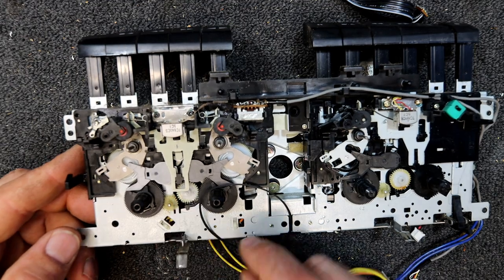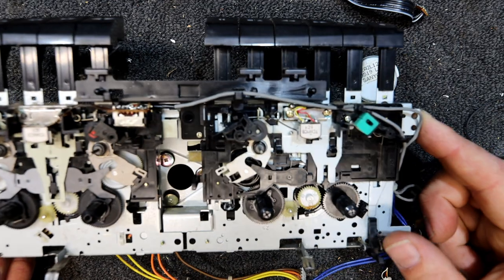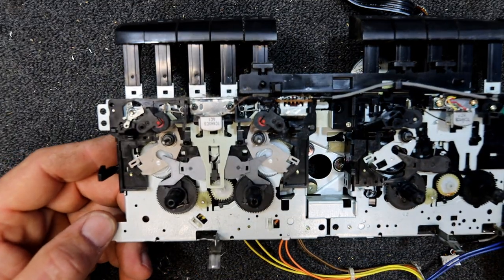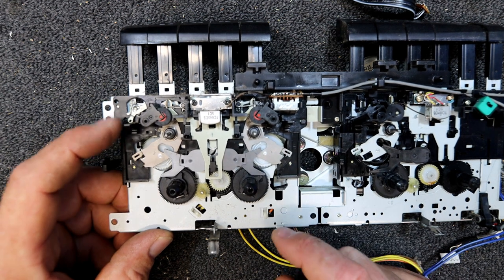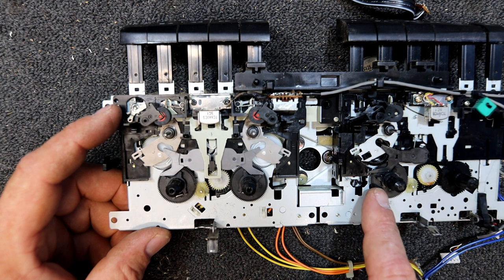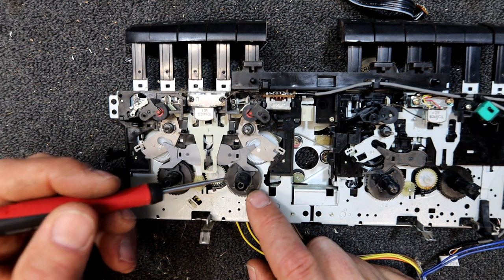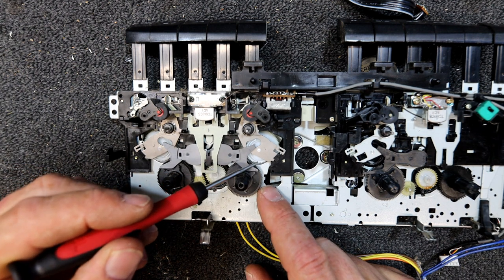So this is our 1059, or what's called a 591 when it's in combo, I guess with another deck attached, if you were doing a dual deck unit. So yeah, two little oscillating bits with a little wheel that rotates round, and these little pieces actually have springs on them, so they're a bit different to the one in this. But these two little pins on the end of this thing can go both directions. If they press on this oscillating bit, they stop it hitting whatever little piece in the cam.